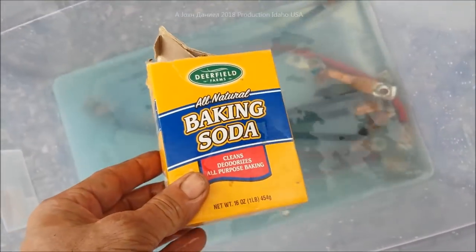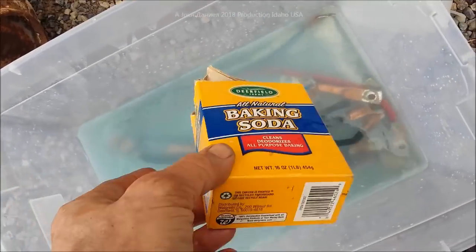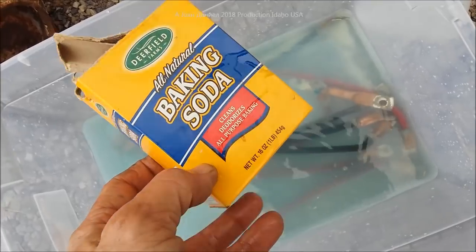I use that same soft copper on my cables for my interconnects, jumpers, and batteries. These are old cables from the old bank — at roughly eight and a half years. You take a tote like this with regular cold water and baking soda, about a third of a box and about four gallons of water, and you can see that color — that's the acid being dissolved off and neutralized. It's safe, you can stick your hands in it.